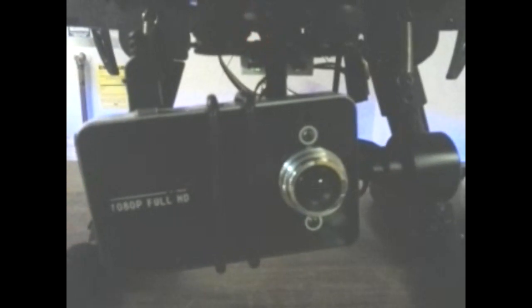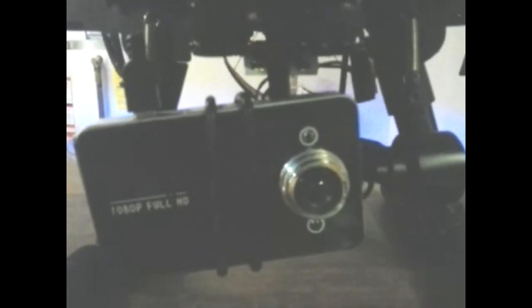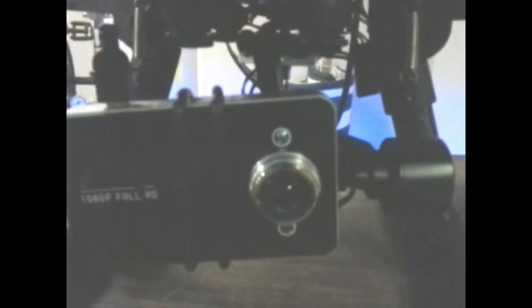And the Q2D gimbal. The camera is a cheapy little — it's called a vehicle black box DVR. She does okay. The newer version has an HDMI out on it — they run you about $24. The cool thing about it is the little USB connector on the top. You send 5 volts into there and the camera automatically turns on and starts recording on a 32 gig card. Then you toggle your switch, turn that 5 volts off, and she stops recording and saves.